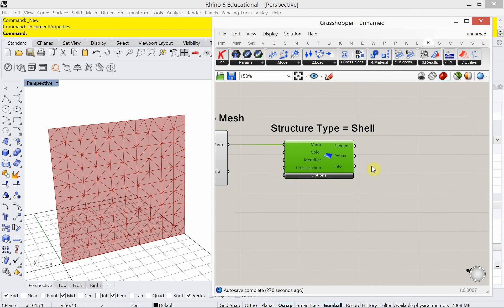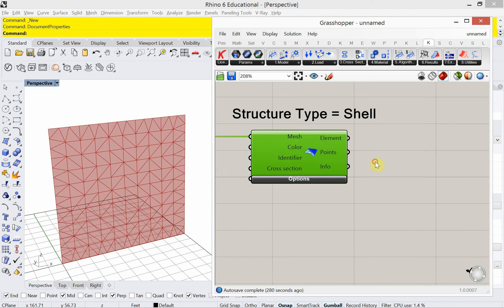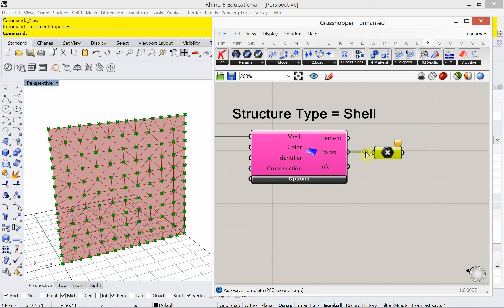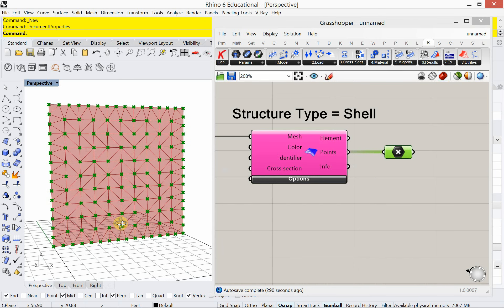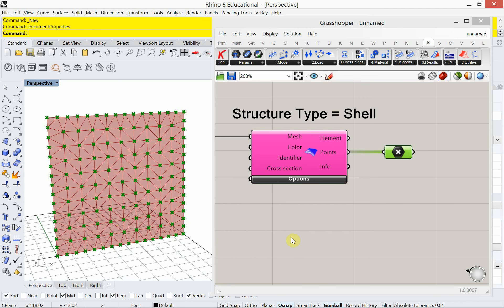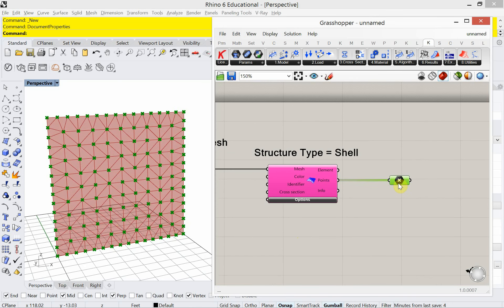On the output of that I'm going to make a point container — there are all my points. Working with this finite element analysis, it's all about defining support points and load points. That's what today's all about. I'm going to work down at the very bottom at the entry and define that entry tunnel load, where we push it back in the Y direction.